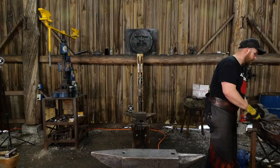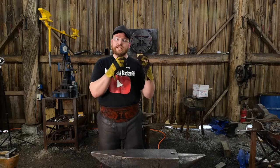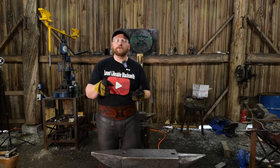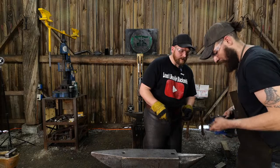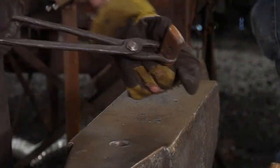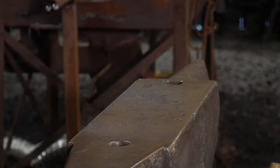large, broad fuller? Now, if you have a soft face hammer, you could use the cross peen. If you have a soft face hammer, that means a chunk of mild steel that's not hardened, you could actually hit the face of a cross peen hammer and use the rounded peen of the cross peen as your fuller tool. I just happen to have the big one. I just happen to have a tool made up for this. Little hand tools that I can use. So we can go to camera number two, Jess. So I've got a tong-held tooling that I can use in replacement of that. So that's what we'll be using on this particular ordeal.